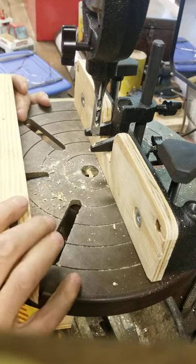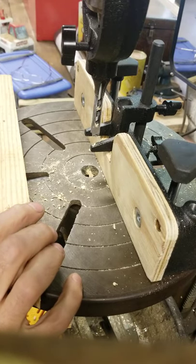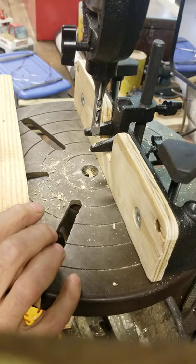And I don't know if you can see it on the camera or not, but I had some issues here, that doesn't fit my collar just right. I had to put a shim in here. There's a metal shim up at the top to make it fit the collar that's here on the bottom of the quill of my drill press. I couldn't do it on the one in my wood shop. It wouldn't work on there at all.